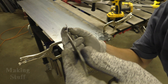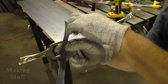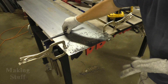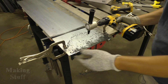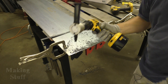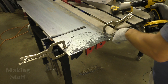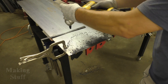Here's the piece I cut off. It makes a really clean cut — there are no burrs or anything. It isn't straight because I was freehanding it, so it's wavy. It reminds me kind of like a jigsaw for sheet metal. It connects to your drill and does a really good job. Another thing I like about it is it's cordless, so you've got a cordless sheet metal tool you can take out in the field. This is 16 gauge steel, which is pretty much pushing the limits of the tool.